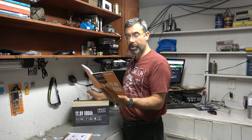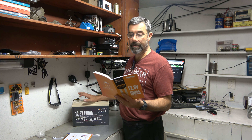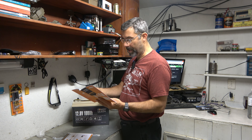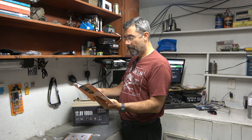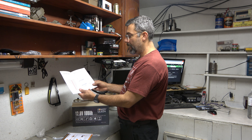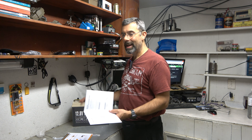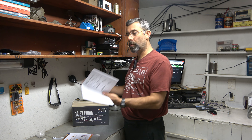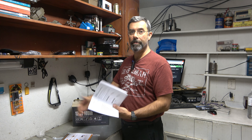For a charge controller, it's looking for a 20-amp or 50-amp. If you're using a 50-amp, it can charge this in two hours to 97% capacity. 20 amps will do the same thing in five hours. You can connect these in series up to 48 volts or in parallel — up to four in series and four in parallel. My systems are 24 volts, so I have 24-volt banks. This will be the second bank of 24-volt batteries because I'm going to slave it with another one.